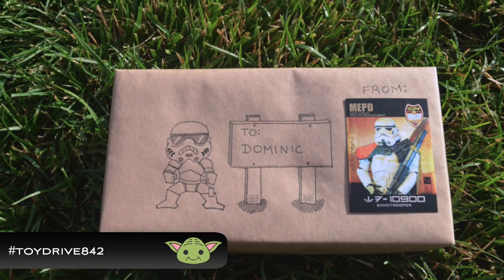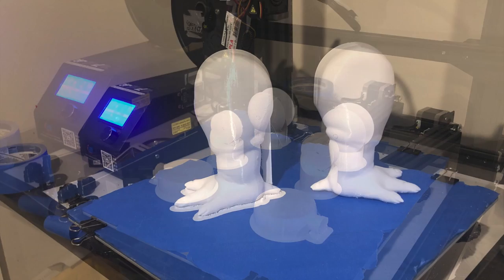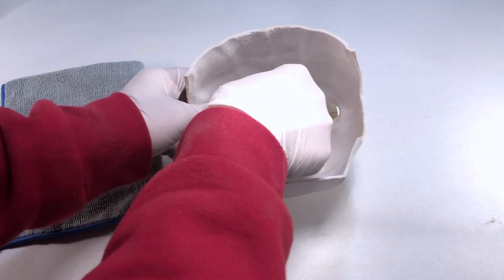All of the pieces were printed on a CR10S using PLA plus filament at a 0.2mm layer height. In an attempt to save a little time and filament, I split the lower torso piece using MeshMixer. I also split the head piece from ear to ear to give me more clearance to work on the eyes. These two changes are not required. Feel free to print the figure as is.